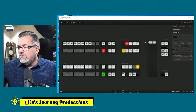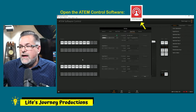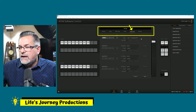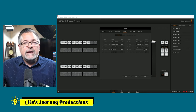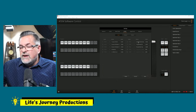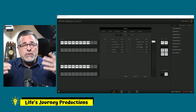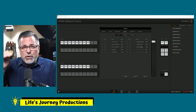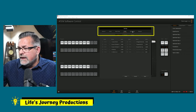Down at the bottom you have the little settings wheel — click on that. You might open to the General folder; we're going to cross over to HyperDeck. One thing you may want to do is go to Labels and label where you have the HyperDeck plugged into your ATEM. I'm in 7 and 8 — I've set channel 7 as HyperDeck Fill and channel 8 as HyperDeck Key, so when I'm assigning keys in my control software I know exactly where they are.